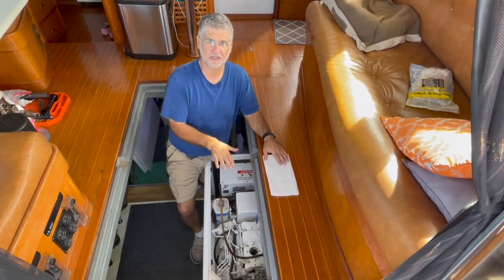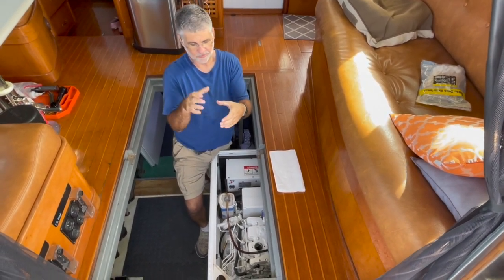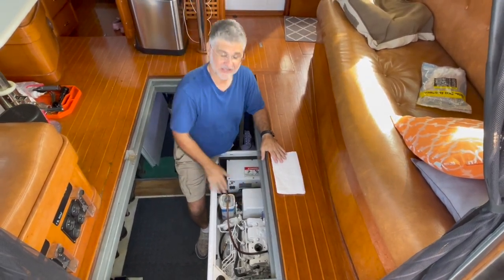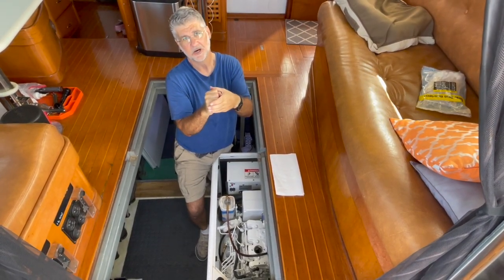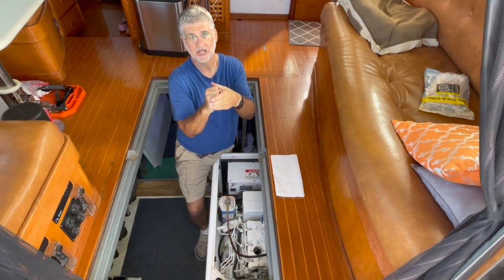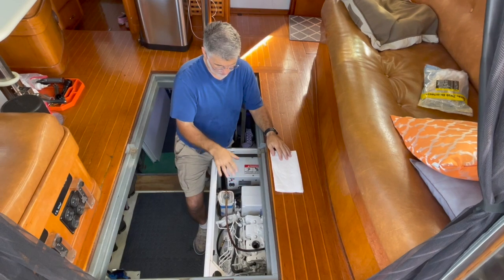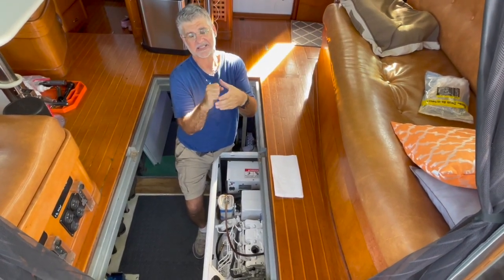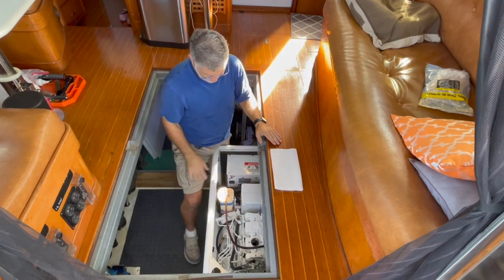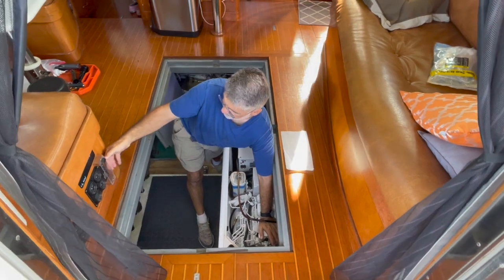I'm going to do this on a cold engine. The cylinders on this block are cast iron and the pistons are aluminum, so when the engine first starts there's a larger tolerance between the two than when the engine is hot. The manufacturer designs it so that when the piston expands at operating temperature it seals the best. So I'm going to start this right now with my hand over the opening — it's going to get a little noisy.